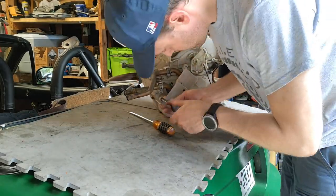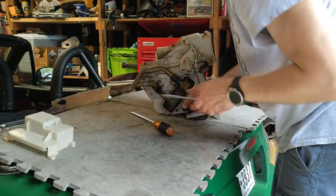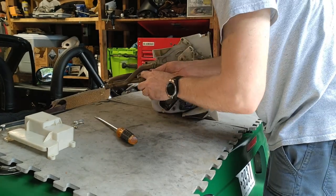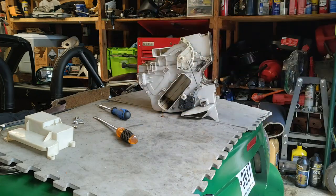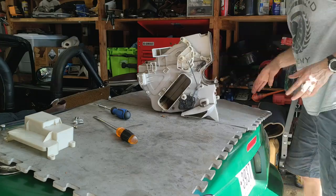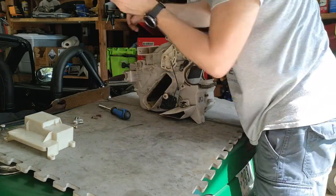Getting access to the foam takes just a couple of minutes. Start by removing the plastic cap covering the heater core itself. You'll need to remove a couple of clips that are screwed in that hold the pipes in place. Then you can slide out the core and inspect it. I've replaced my core before, but after inspection it's looking like it's on its way out — I ended up replacing it again, this time with an aluminum one from a later Miata that is much more durable.